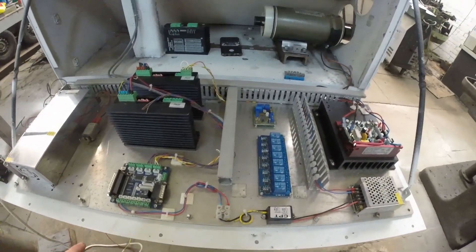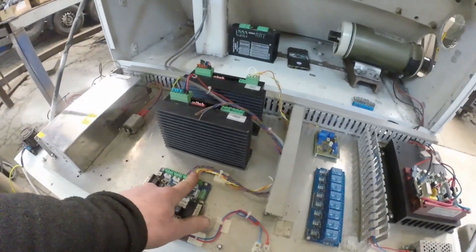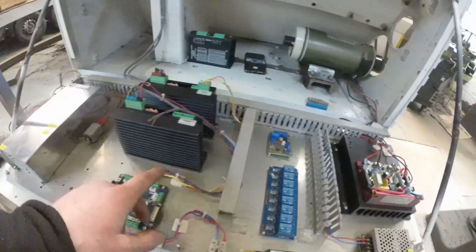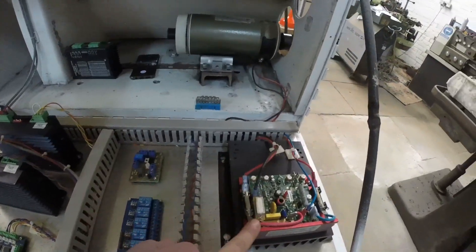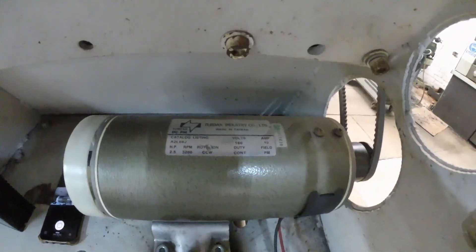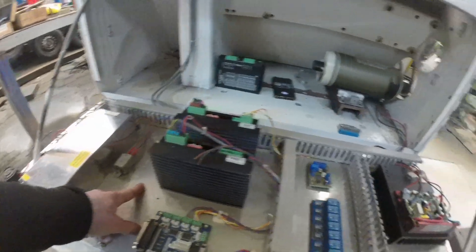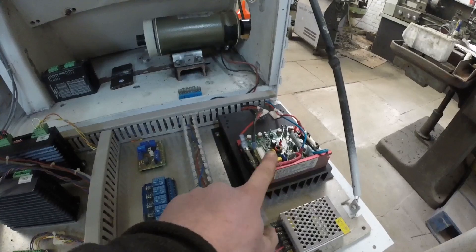Most of the components are here, but we have some wiring left to do and some things to change. I'd really like to change our signal cables to the stepper drives to shielded ethernet cable — I find this works well in all our builds. We'll need to connect up our motion control board to our driver and then into our treadmill motor. We also want to put another line filter in for the driver, because we're probably going to get some noise from it.